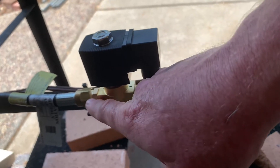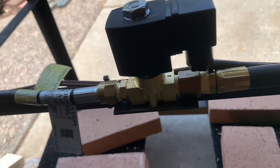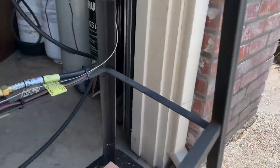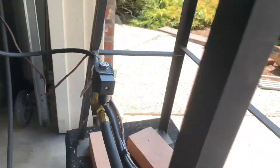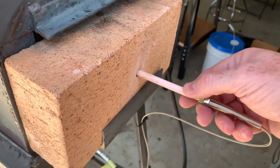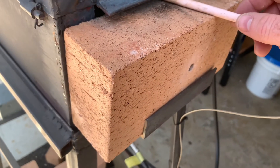These cheaper Japanese solenoids can only be mounted horizontally — not vertically. No thermocouple that I'm aware of can be mounted upside down either. Because this runs on 120 volts, I use a standard electrical plug into my wall socket. If you run 12 volts, you'll need a DC-to-DC relay, and if your PID controller outputs 12 volts you can eliminate the extra wall-plug wire.